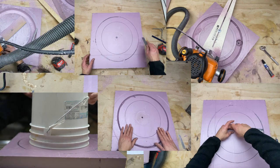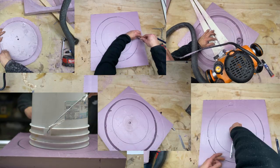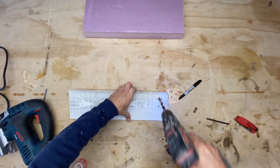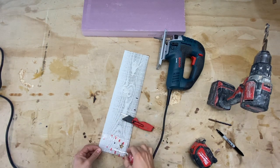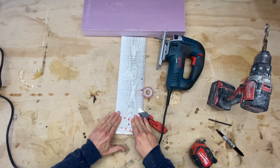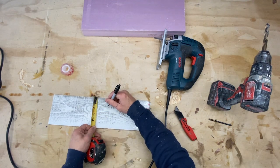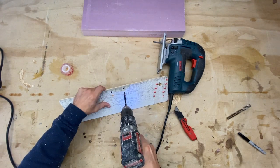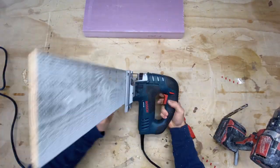There were a number of different ways I tried making a perfectly round circle, but the easiest way was incorporating a jigsaw into my cutting apparatus — by far the easiest and probably cheapest way. All I needed was one piece of flat stock wood and some 3M double-sided sticky tape. The jig has three holes: one for the blade itself, one six inches away, and one eight inches away, giving a 16-inch outer diameter with a 12-inch inner diameter.